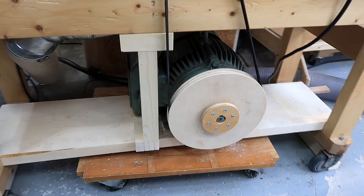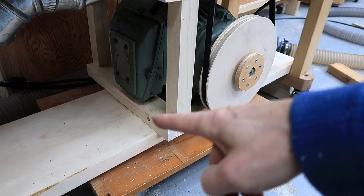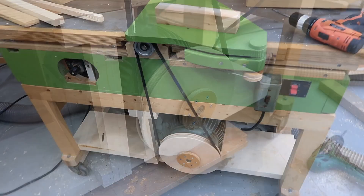This bracket ensures that the board the motor's on doesn't warp and keeps it properly aligned, because this belt and pulley is very sensitive to misalignment. I got my bracket mounted so that motor is now rigidly in place, and I got the switch from the new motor too.